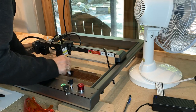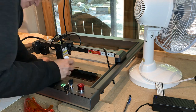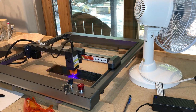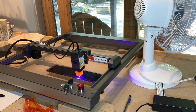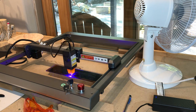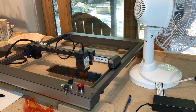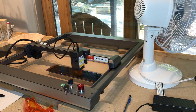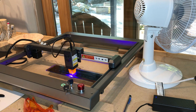The next project, while it looks like wood, is actually a glass tile from one of the big box stores that has a wood grain pattern on the back of it. When you're engraving glass, acrylic, or anything else that's clear, you need to have a dark coating on it — otherwise the laser just goes right through it. In this case I used a black whiteboard marker. Going forward I would probably use spray paint or acrylic applied with a foam brush for a more consistent coat. The whiteboard marker has a tendency to be a little streaky, and you can get some lines, but that's only because the whiteboard marker finish is not uniform — it's not a product of the laser or the engraving.